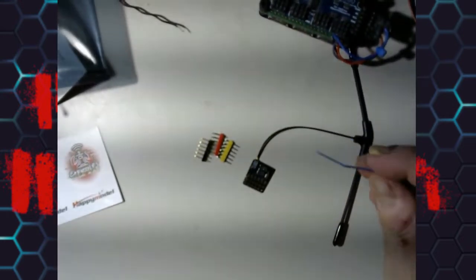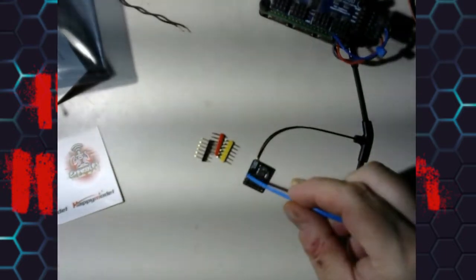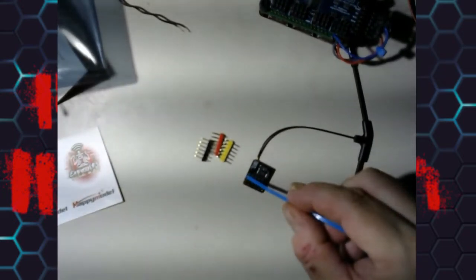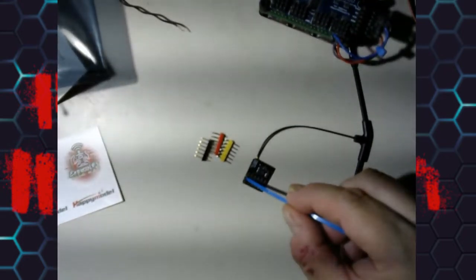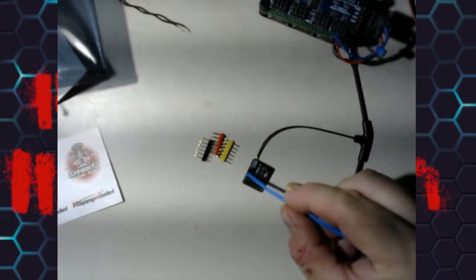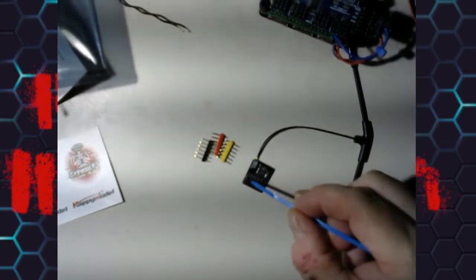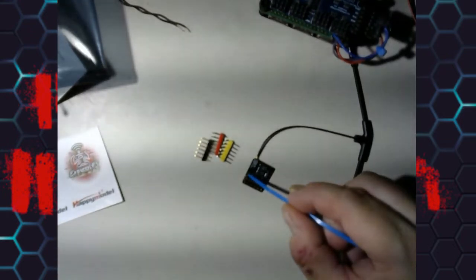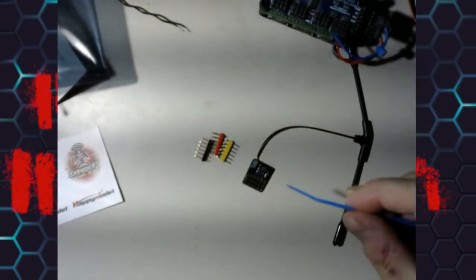So when you solder on these, I would be very, very careful about how much heat I apply to this first row where it's so narrow on this side. This side seems to be wider, but I'm wondering if there's a problem right there. That would be the one I solder first, and then I'd move on to the other ones. Actually, that will be the first one that I solder on the entire row of everything, which will keep this narrow bridge the coolest. And I will be doing it probably from this side, with my iron basically coming in on this side of the pin, just like my blue zip tie is right now.